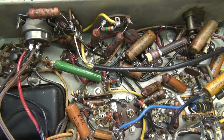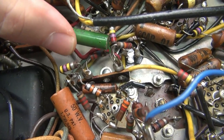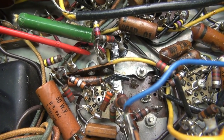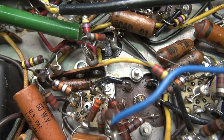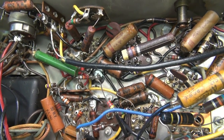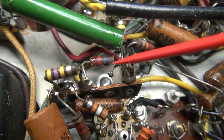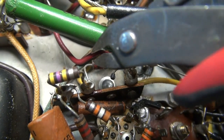The other thing I was wondering was why is FM trying to work and AM is completely dead. Well, upon inspection, if you look under this resistor you'll see another resistor sitting right there — and he's broke. See that lead? It's busted right in half. Obviously something hit it in the past. That's a 22 meg resistor, and by looking at the schematic I found it goes to the AM detector tube. So we're going to swap that first and see if the AM comes to life.